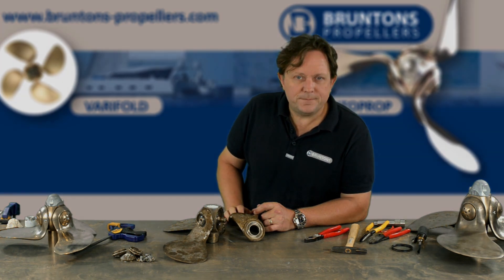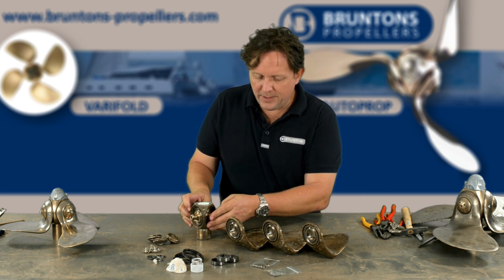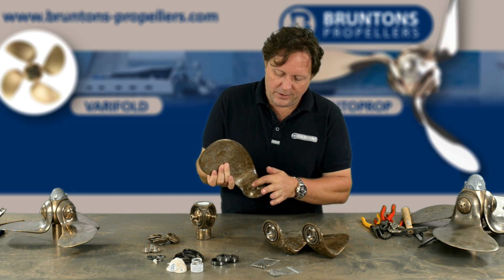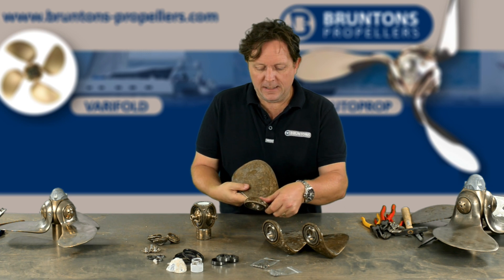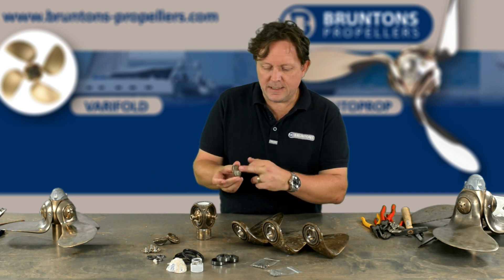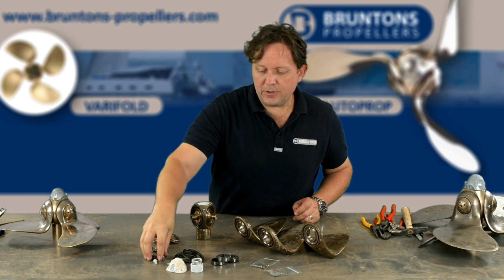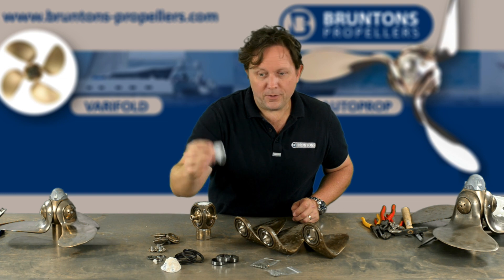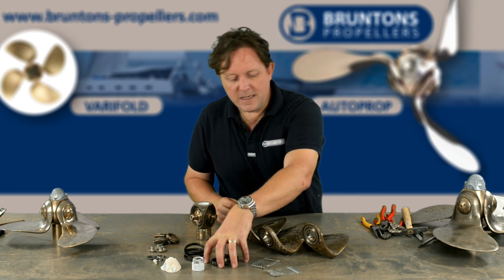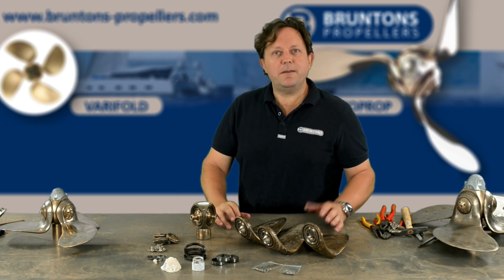At the end of it, you should have your hub with nice clean tracks and no markings, all your blades with the lip seals removed and clean tracks on the inside, with no bearings remaining inside. All threads should be clear of any Loctite or ablative paint. You'll have the caps — with the o-ring seal to replace — the tab screws (keep these, they're handmade and valuable), the bolts, the prop nut (expensive and custom), the lip seals (keep them, hard to find), taper roller bearings, and ball bearings kept in bags. The blades are marked so I know which station each came from.